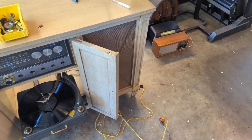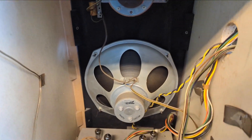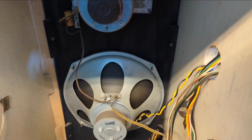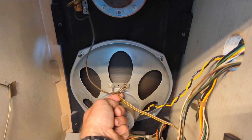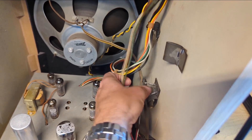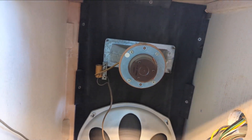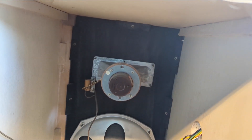I also seem to not have a tweeter here — I notice there's a capacitor going in and either I've got a bad connection or a bad tweeter element. I'll check for connections and then check the tweeter itself, see what ohms it reads. We've got plenty of horn tweeters at the museum so it's not the end of the world. Turns out the tweeter horn is completely open — tested both and one is open, so I need to replace it.